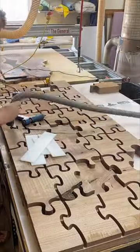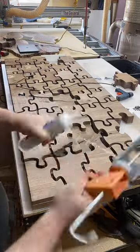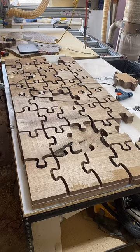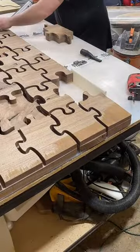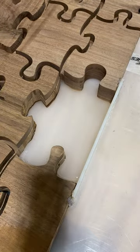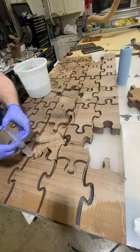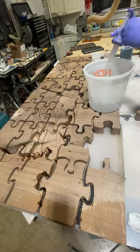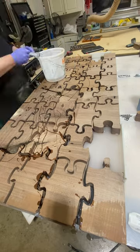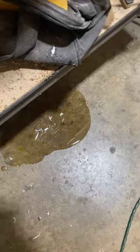It's now time to jump into the mold making — I screwed it up pretty good but I think we can salvage it. Started with a little vacuuming, put UHMW strips on to seal up the big holes, then used silicone for the smaller ones. We're going to pour some tabletop epoxy — the good old Wise Bond — to seal the bottom of the table so we can peel it off, cut the edges, and then do the big pour. Tabletop epoxy is about as thick as peanut butter, so I used a syringe to fill in the cracks down to the edges. I put a little too much epoxy in and it pushed under the wood — big mess.